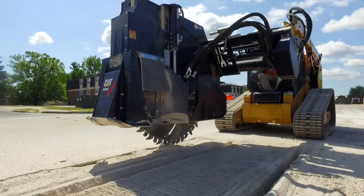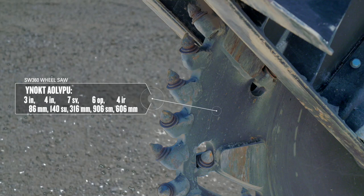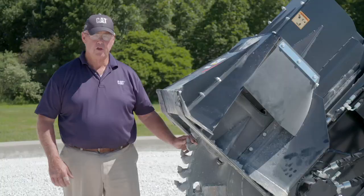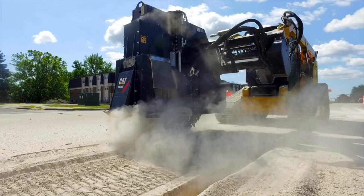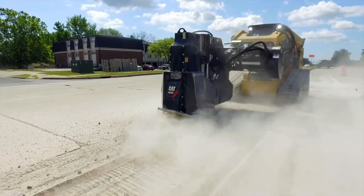The SW360 comes with several wheel options. We have depth of 24 inches, along with wheel widths of three inches, four inches, five inches, six inches, and eight inches. Four, five, six, and eight inches all come with a standard trench cleaning device. The tool is delivered with conical bits. The conical bits spin as they go up through the concrete and the asphalt to do the cutting. We have tools mounted with the attachment that allows removal of these bits.